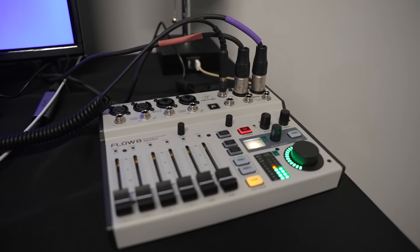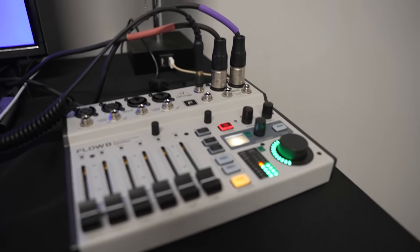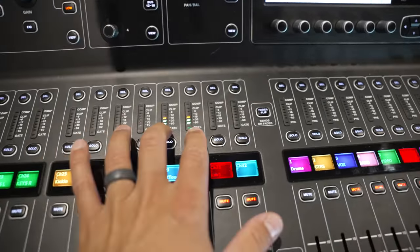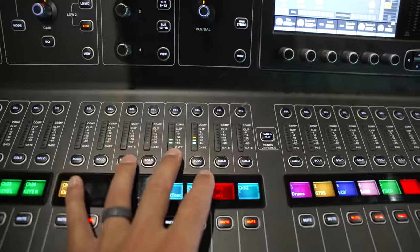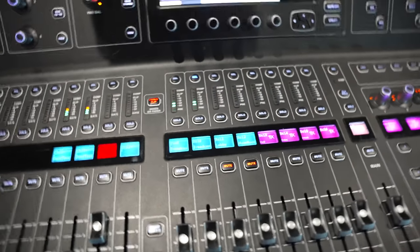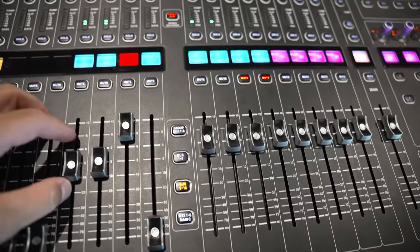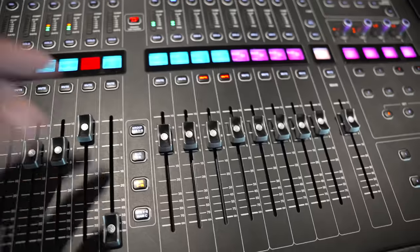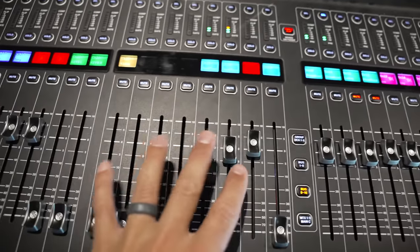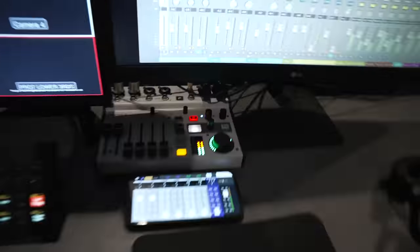Audio is coming left and right out of the Behringer Flow into our stage box on the other side of the stage, and then we'll see it back at the M32. Here at the M32 you can see we've got stereo channels — these are our audio feeds, left and right, for our Logic Pro broadcast mix. This gives us the flexibility to route that audio pretty much wherever we want. These channels are sent to our broadcast mix bus, which contains the band audio coming from Logic and the speaking audio — we have a mix bus with talking mics and band music combined. This mix bus has an output on the back of the console.